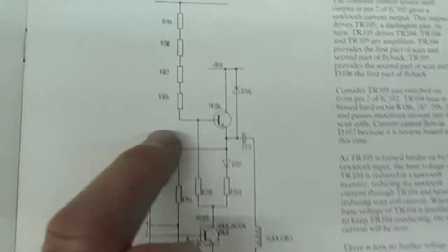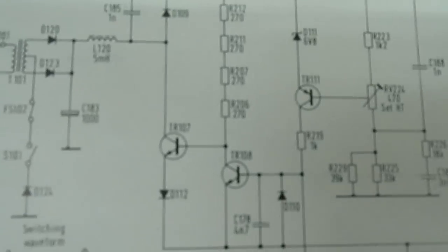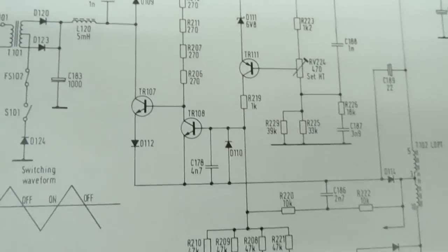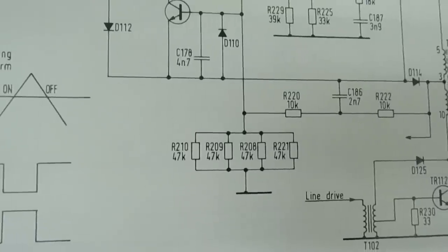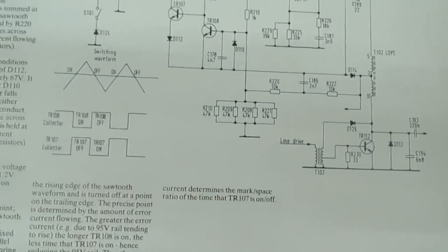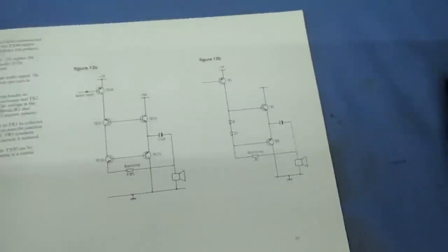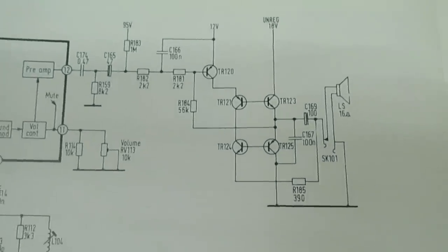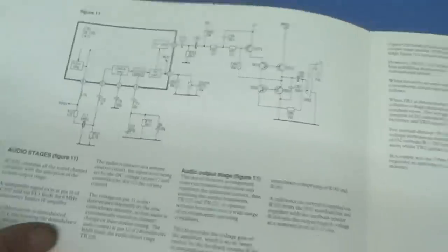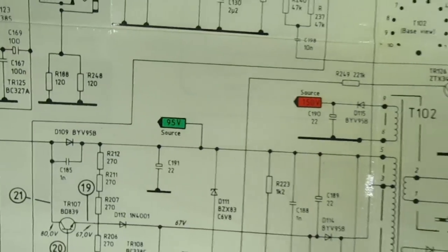In the frame output you can see four resistors in series, and in the power supply there are another four resistors in parallel. I think it was all done just to save on production cost — the small resistors would be a lot cheaper than using a larger one. The sound output stage is incredibly simple — just a handful of parts fed from an IC. The circuit diagram has all the important rails marked in different colors, making it really easy to trace anything.